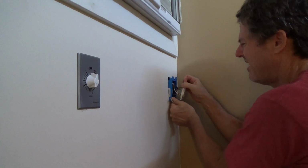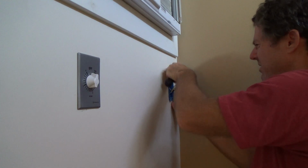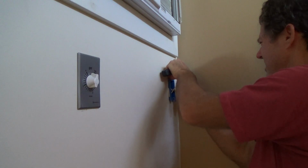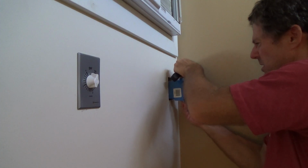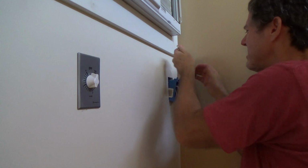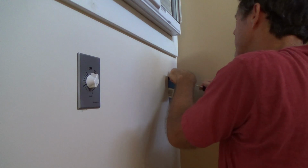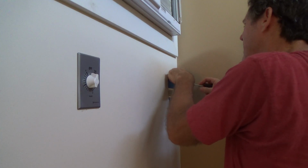Okay. Now I'm gonna have to pull this out. I've already shut the power off and stuff. I can pull this out far enough. See now, once I get these wire nuts out of here, like this, I might be able to pull this box out a little bit further here without undoing everything, okay? And I think I can just undo this. It looks like, oh, okay. The little plastic thing is still on here, so the threaded bit, I'm taking that off right now.